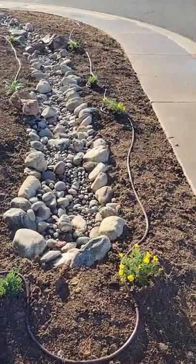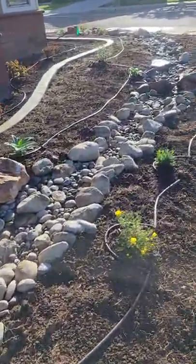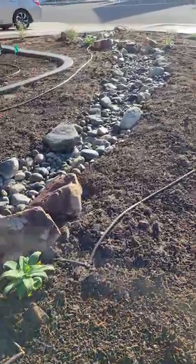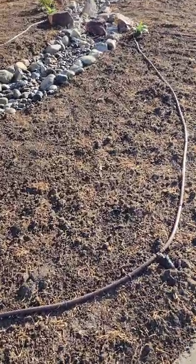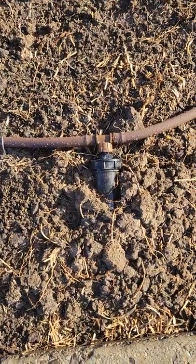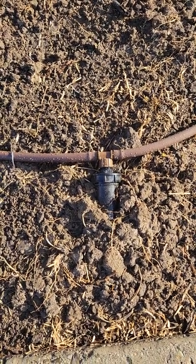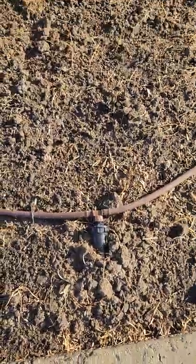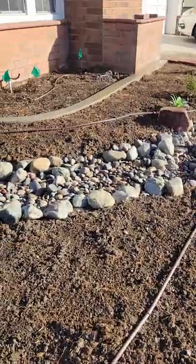Hello and welcome back, this is Ed Wallace of Midwest Landscaping, www.uniqueenvironments.com, back here in Irvine. Just finished the retrofit of the drip irrigation here at the job site for our front yard landscape renovation. The project calls for retrofitting the existing sprinklers to the Rain Bird 1800 retro kit, which has a pressure regulator and a filter inside that pop-up body, and has a dual port so we can go to the left and to the right.